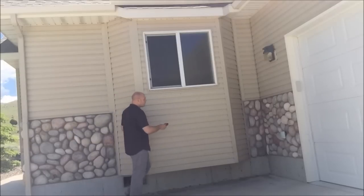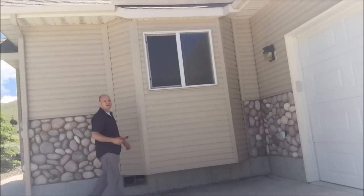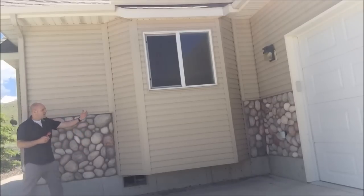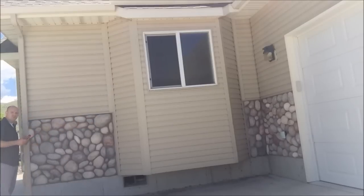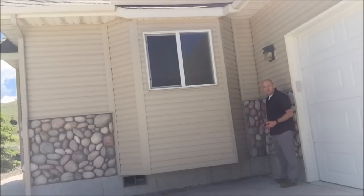Then I can measure this wall here and this wall here. To double check what I'm looking at, a really cool thing you can do is bring your cursor back to this starting point on your sketch — not anchoring it — just bring it back to where you're starting, then stand here and shoot to that far wall and measure across to make sure that everything matches up. That way you know that you've got a good angle.